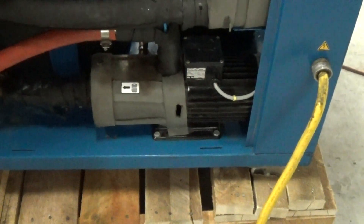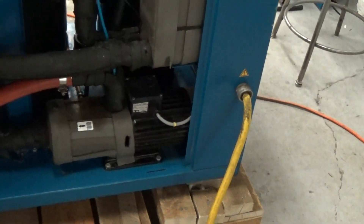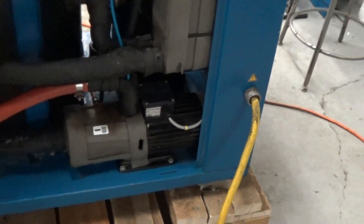The tank has to be about two or three inches below that drain level, or else that float switch will turn on. This uses a really nice high-end Grundfos pump. That pump is insulated. If you see that little slot there in the insulation, that's important — when you do start this up, that's where you can peek in with a flashlight and with two people bump the pump just for a few seconds to confirm that we have the right phase rotation.